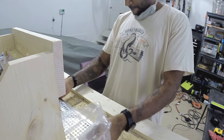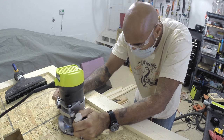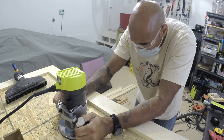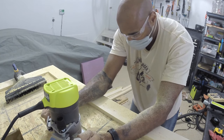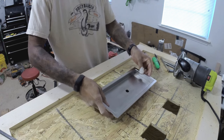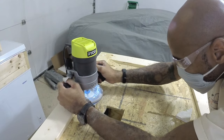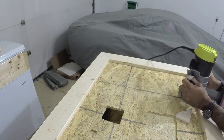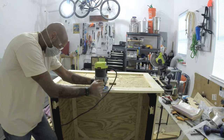I drilled my drain line for my drip tray and also had to route out the difference to make sure it would be the proper depth so it would sit on top of my travertine tile and not stick up above it. After that, I used the router to smooth off all the edges of the rest of the wood pieces for the trim top.